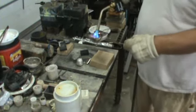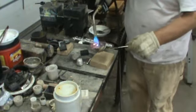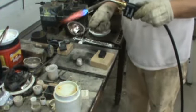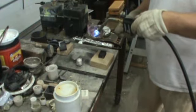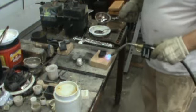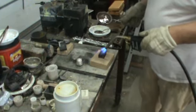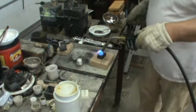What borax really helps do is — the silica is very porous, and if you just melt metal in it, it's going to stick to the silica, especially if you let it fill it. We've got our metal. Any time you use carbon graphite, you should take a little bit of time to preheat it. Primarily what that's going to do is spill out or dry out any moisture that's in it, so when you pour hot metal into there, it's not going to blow it back in your face. We just need a little bit of heat into that.